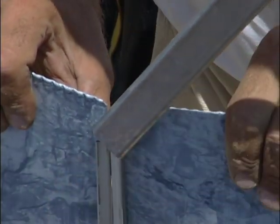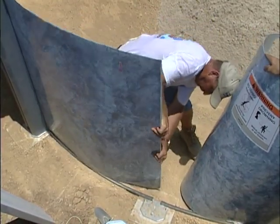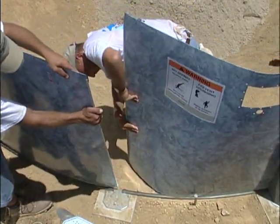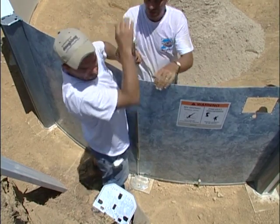When the wall ends meet, make sure the joint will be at the center of the vertical end cap. If the wall joint either overlaps or is short, you can adjust the circular end bottom rails in or out until the wall ends meet properly. Be sure to adjust all bottom rails equally or you will not have an equal distance between each top rail. If you have a pool with two walls, you will secure the wall splice by using a joint connector. To make securing of the wall joint easier, remove the stabilizer rails from around the joint and pull the wall back so you have enough flexibility to align the ends correctly. Secure the wall ends of a slide joint configuration together by using a little WD-40 or dishwashing soap on the wall ends and the slip joint connector. This will allow the tight connection to slide easier. If sliding the connector is still difficult, tap slightly with a piece of 2x4. Do not use a hammer — this will damage the connector and the wall, weakening the joint.